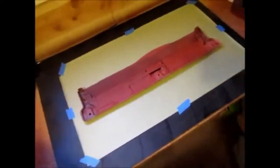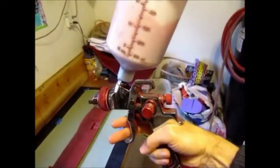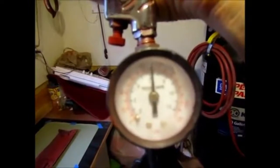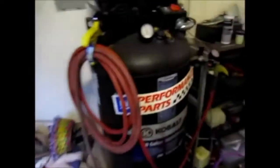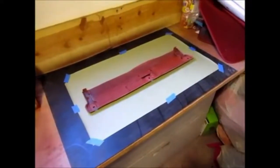Let's take a look at it when I put it on the first side. Here's the gun I'm going to be using — this is my 1.4 tip gun and the pressure I'm going to be spraying it at is about 23 psi and the line pressure is about 90. So I'm going to start spraying this and we'll check it out when it's all done.